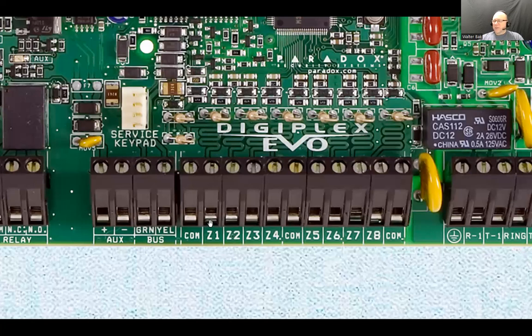The system can be programmed so that, for the most part, if there is a dead short between the zone and the common, then the zone is at ease, right? So if you just connect dead shorts, run cable conductors and connect them to the commons here, ground everything, then the whole thing is at ease. But what's the purpose of that? If you bring a wire out of the common, it will become a pair. The wire used for that is a quad, so it has 4 conductors.